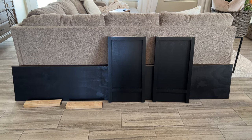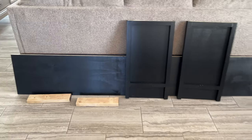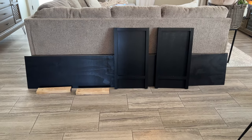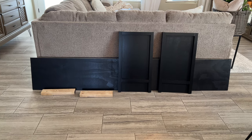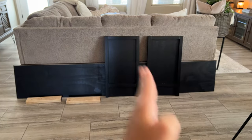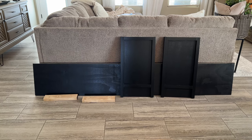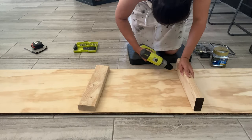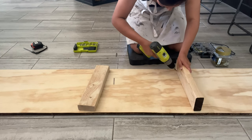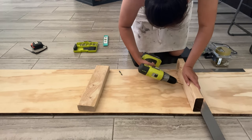It's the following day and everything is painted. I just cut 15-inch pieces of two by four to use as kind of legs for the bottom part, because the bottom part of the entertainment center is kind of floating — it's not level to the ground. So let's go ahead and start assembling. To add the legs, I just flipped the piece around, measured 31 inches from the outside and put the first leg, then 31 inches from the other side and put the second leg in. To attach the legs, I just used one and one-fourth inch screws and screwed them in from the side — kind of like a pocket hole type look.